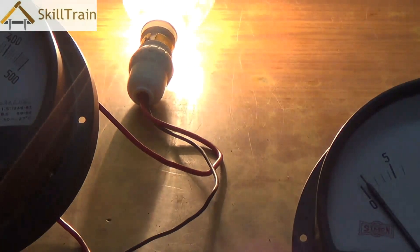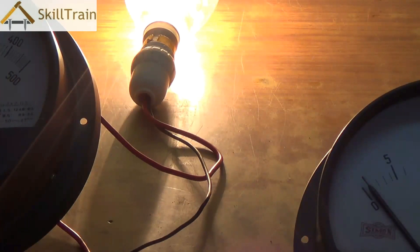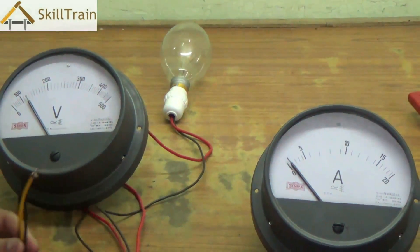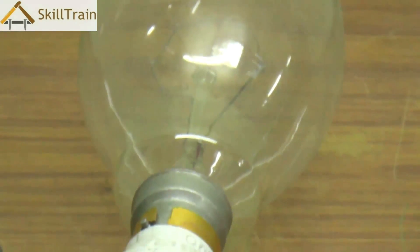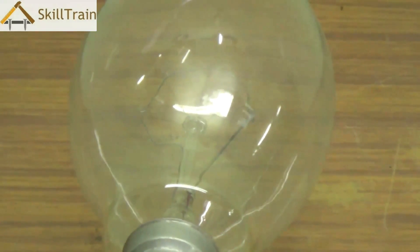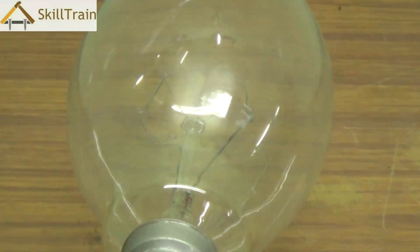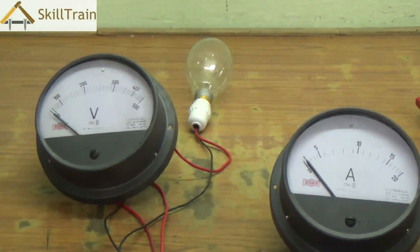The clamp meter or tongue tester gives you a much sharper reading, whereas the analog ammeter gives an approximate reading. Digital tools are available these days and are far easier to use because they do not require you to connect any wires to specific components. To summarize: the amperemeter must be connected in a series connection and placed either at the phase line or neutral line of the resistance. The voltmeter needs both phase and neutral supplied directly to it, so it is always connected in a parallel connection.